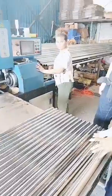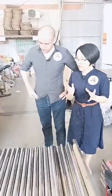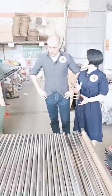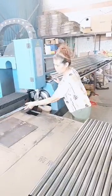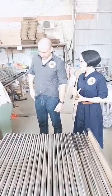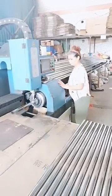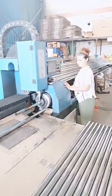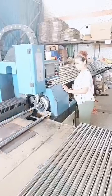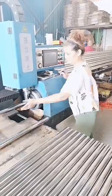One of the differences between the circular saw and the laser cutting is the cutting loss. For the circular saw, each cut will take about 0.5 mm in cutting loss by the chip shape. But for laser, it will take only about 0.1 mm for each cut. So it can save a lot on material.